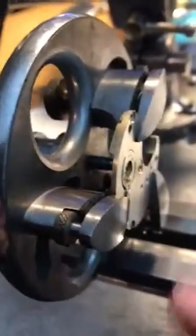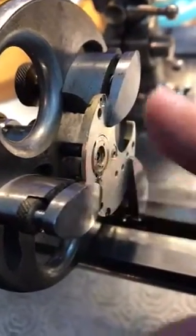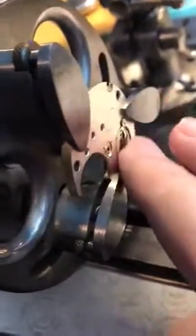There's nothing on the plate side that is making it be warped at all, and it's dead center based on the stake on the inside that aligns it. I did this while the faceplate was off — I took it off, then put the plate in there, tightened one, used the stake in the center to align it, then snugged the other. I made sure I snugged them on all the high pieces of the plates on this watch so they're all even, and you've got to make sure all of the thicknesses are exactly the same — that's how I set it up.